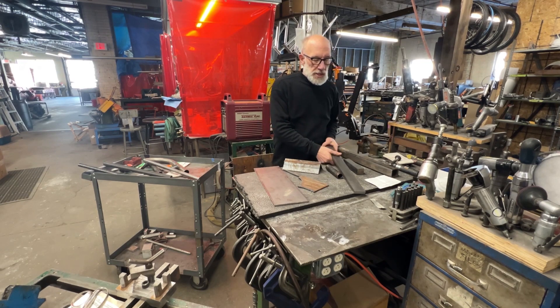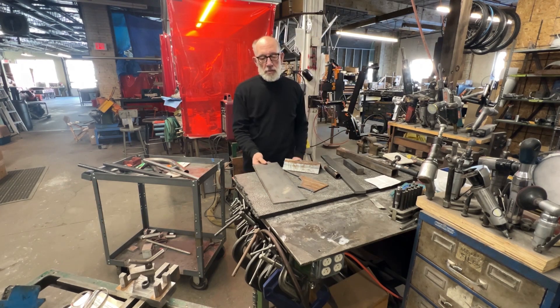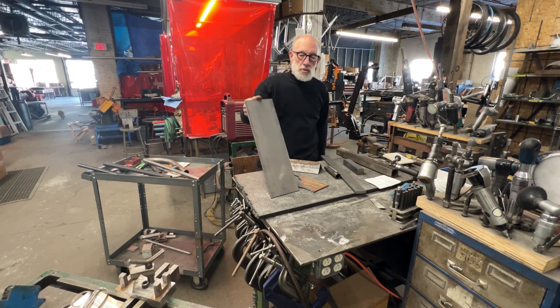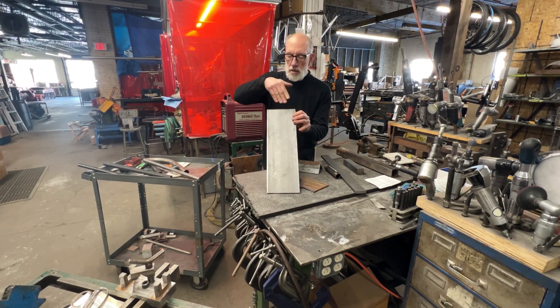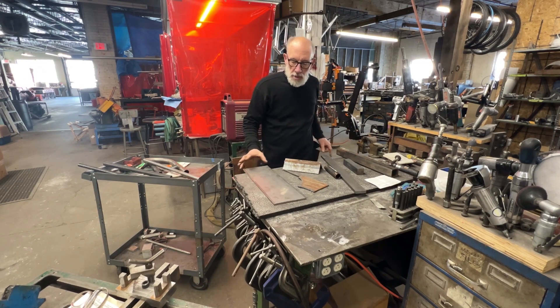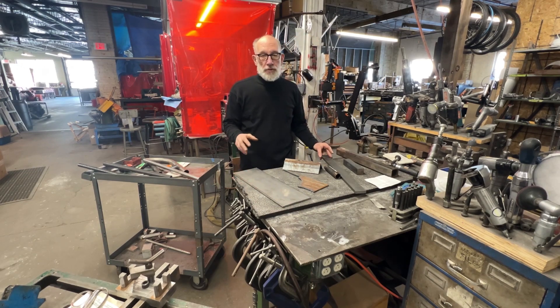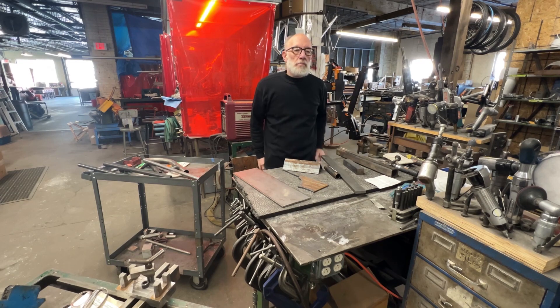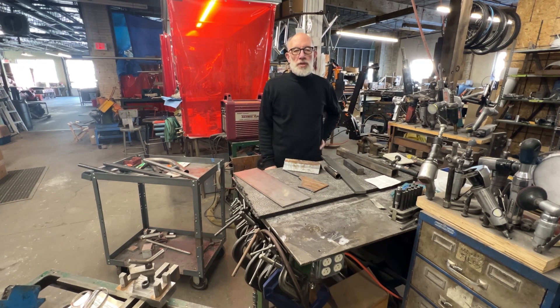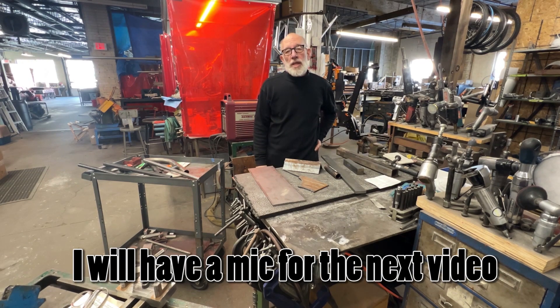It's available in fractional sizes and some metric sizes. Here's another shape — this is about five or six inches wide by quarter inch. It's got a little bit of a bow, probably 10 or 15 thousandths. Otherwise it's pretty nice and usually pretty straight. I'll use this stuff for tooling fixtures, for parts that people are going to be looking at, coming in contact with — stuff I want to look good. One of the great things about it is that because it's already clean, you don't have to grind it and you get great welds. It also drills and taps a little better than hot roll.